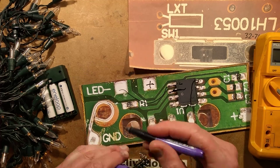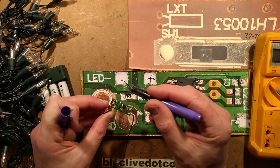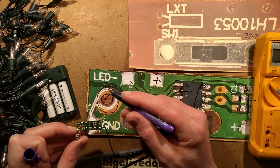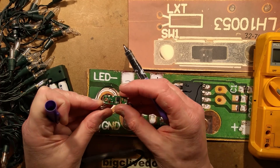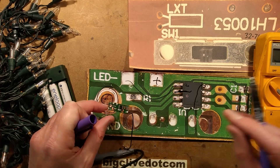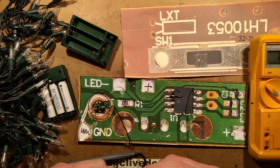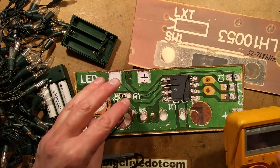Another really nice feature is that the spring from the battery pack is soldered on, but it also has a loop that goes around so when you screw it in with a screw it clamps it down. There's evidence of melting in the battery pack area, suggesting they soldered it after it was already in the pack. That's clever because it takes the strain off and also anchors the circuit board in place.